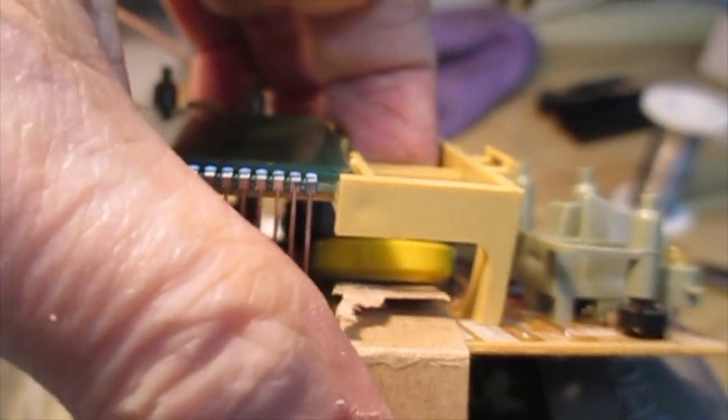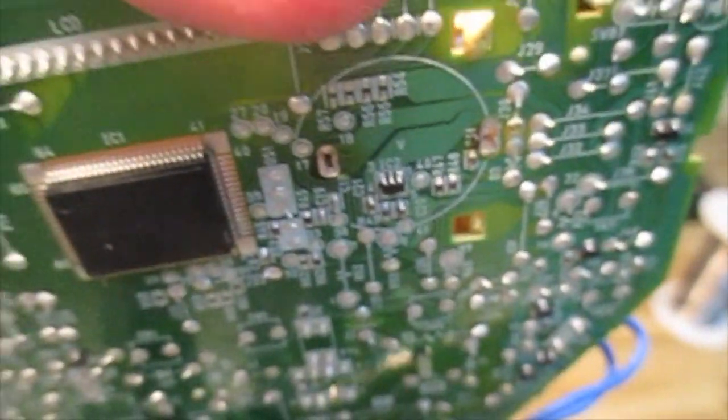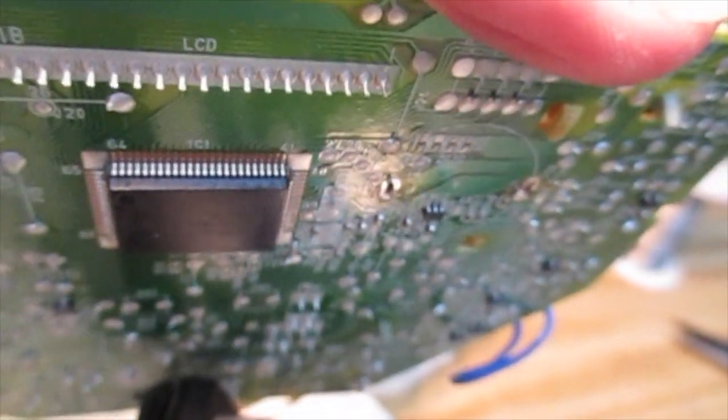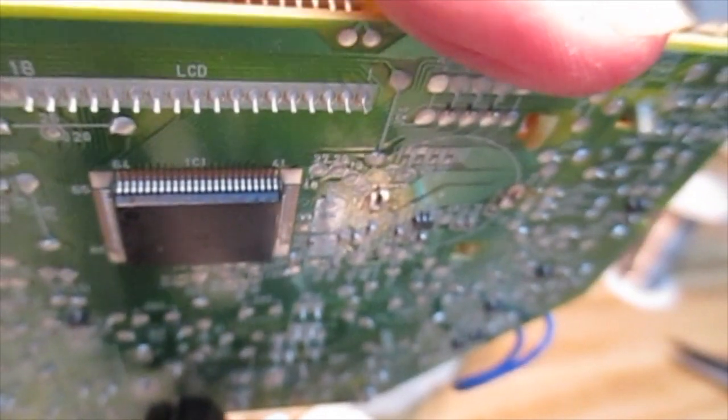This is very important. Alright, so you may recall that the original battery was not quite flat to the board. I've got it more or less into place here. I shoved a little piece of cardboard underneath just to space it off from the top of the board, but that does still leave us with a reasonable amount of pin sticking through from the bottom. I don't know if you can see them very well there, but you should be able to see the two pins sticking through. So now I'm going to solder that all into place.